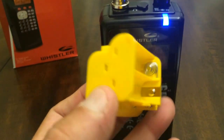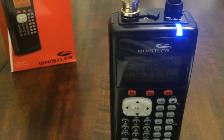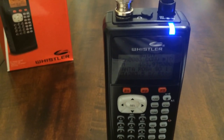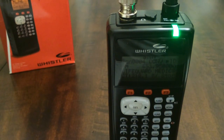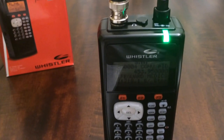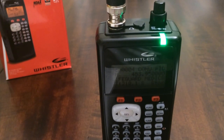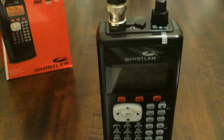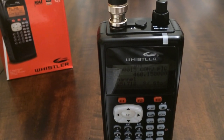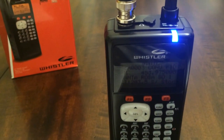Be sure that when using alkaline you're using the black power pack, and when using rechargeables, use the yellow sleeve battery pack for the scanner. Your typical charge time with nickel metal hydride — for example 1600 milliamp hour — is about 16 hours. Nickel cadmium at 600 milliamp hour takes about 6 hours, and at 850 milliamp hour about 8 hours.